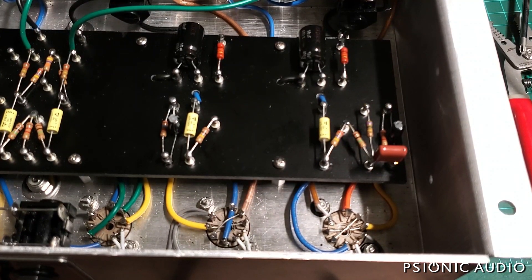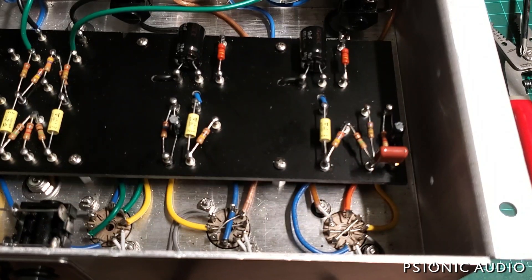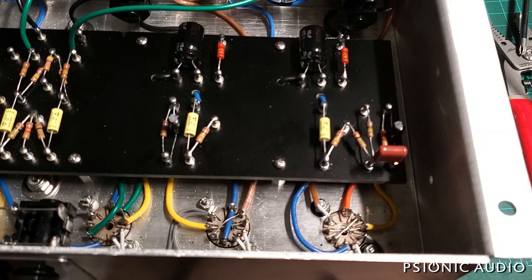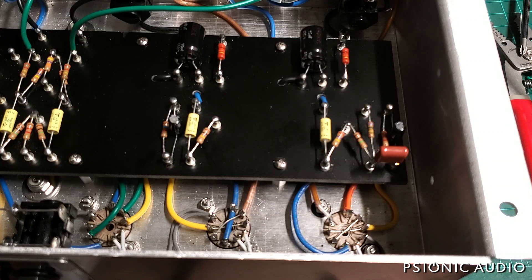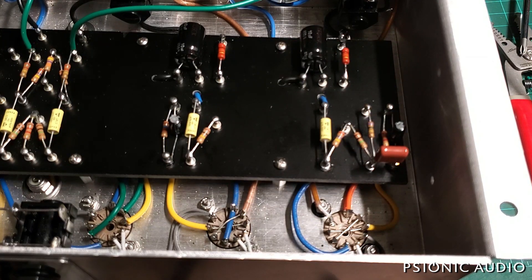I don't mean to sound snobbish or elitist, but I want to be really sure that no matter what EF-86 someone puts in here — as long as the tube is not defective — the sound and response will be what I intended. There are a lot of current production amps that use EF-86s. They just kind of copy what Vox did and shove it out the door, no matter what the voltages are or what's actually going on. As I mentioned in the previous video, the Vox values do not guarantee the Vox sound — it's a lot more complicated. I'm going to get this set until I know that every one of these I build will be consistent.